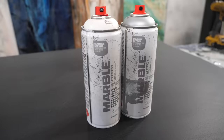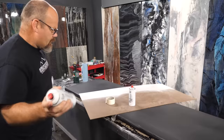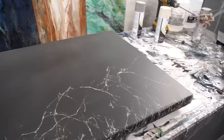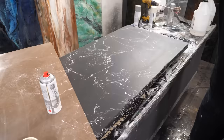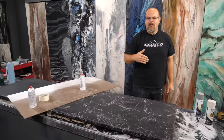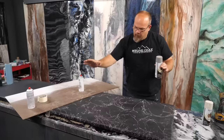I've got white marble spray and silver marble spray going over a black undercoat — that's our epoxy undercoat. Test that spray first. I'm going to do the edges first, and then I'll do the field. The marble spray dries really quickly, so my spray fan will be able to be laid right on top of that marble spray almost instantly, as opposed to the granite sprays — they take a while to set up. So I'll do that second so that I can mask off this section and then spray the granite.